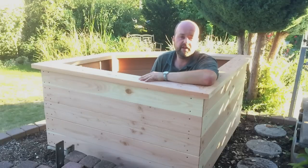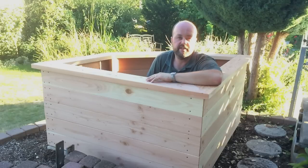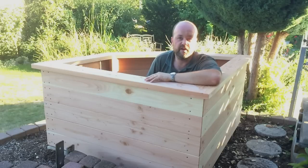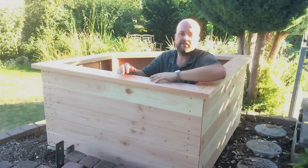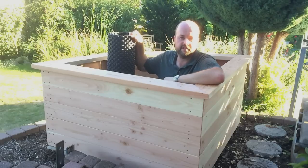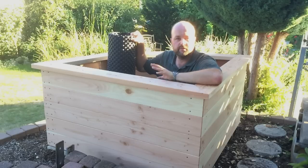Now this thing is finally done. It has taken me quite a bit longer than I had thought, due to some mistakes I made but also because those angles were quite difficult to get right — I really had to think it through and measure very carefully. I'm really pleased that it is finished now but also quite exhausted after a full day of work, assembling it in full heat above 32 degrees. With two boards lower than in version one, I really like the way it is now and it fits just right into its place. The only remaining thing is to cover it on the inside with plastic sheets with studs on it — the studs make sure that the wood gets some air and that the soil doesn't get into direct contact with the wood, which hopefully makes the Douglas fir last a little longer. Thanks for watching, see you next time.